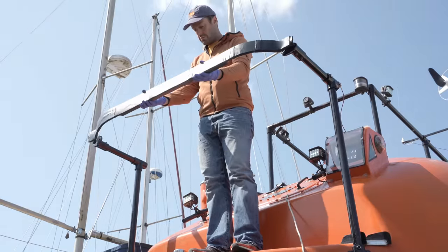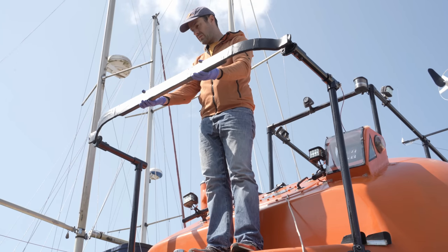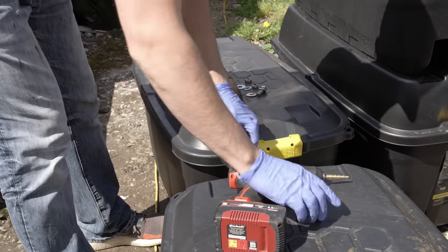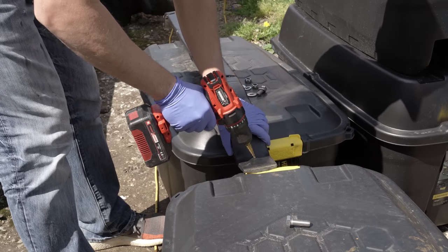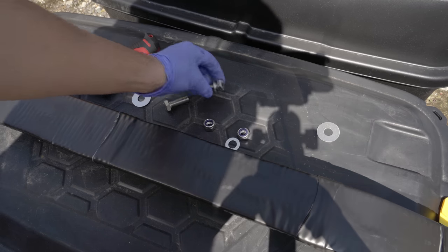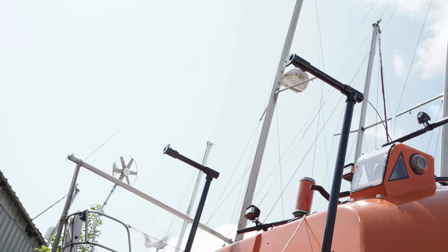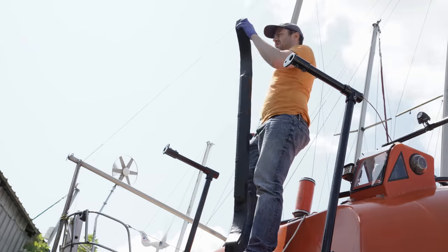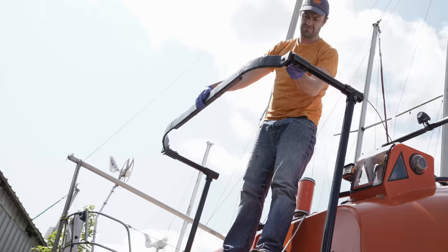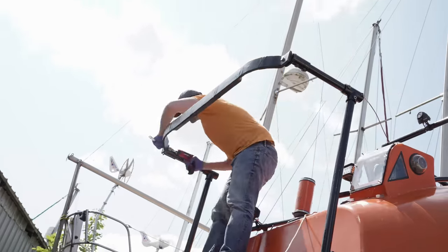It's still pretty lightweight, and it does span the full gap — I would have had a moment if somehow it was too short, but it wasn't. It needed some holes in it if the bar was going to stay up, so I did that with a drill. I did a final check that the bolts — which I've recently become aware I should actually call set screws, but will continue to call bolts — pass through with a slight resistance. The crossbar still spans the gap, and as I did the whole washer and nut thing, we had a success. But if you fell against the railing in its current state, you'd not break it, but it would likely deflect more than you'd want.